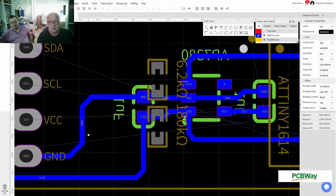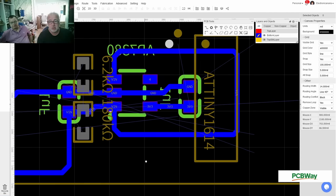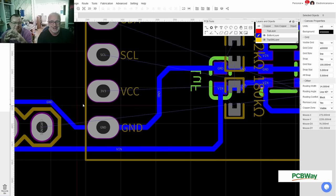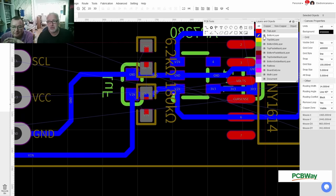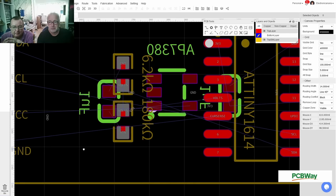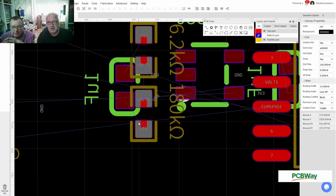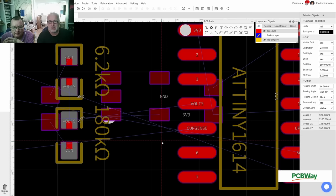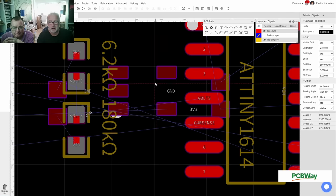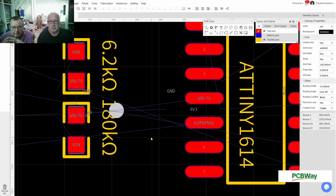And the horrible ones will be SCL and SDA, so the data lines for the little display. Well, we'll live with that. Okay, current sense is on the other side. Let me go back to the upper side. I don't need the bottom layer. This starts to look a bit horrible here. Let me get rid of these. Ah, very much better. These are the pads from the voltage regulator. Why do I see them? Oh, because I'm selected here. I selected this. This is why I saw them.